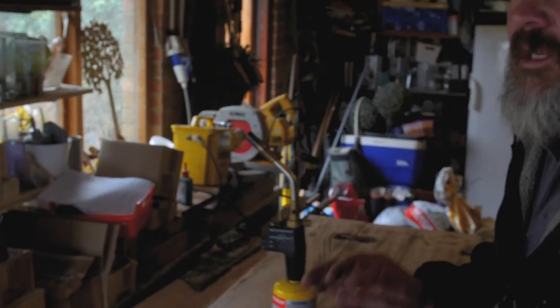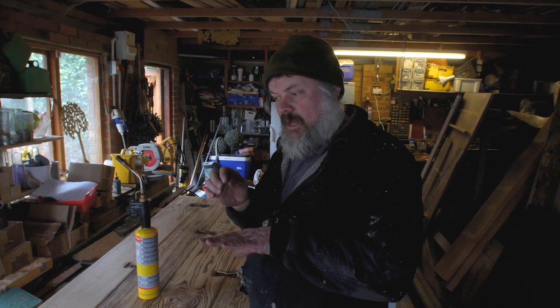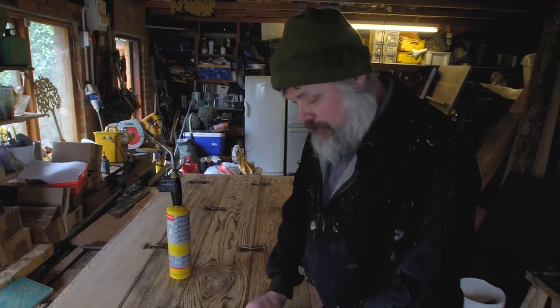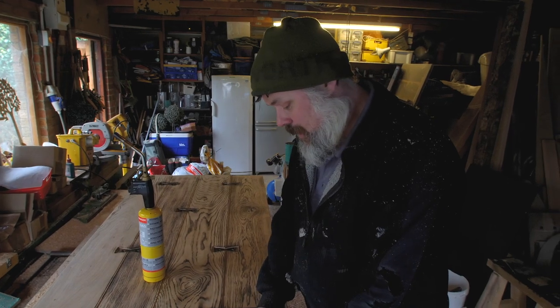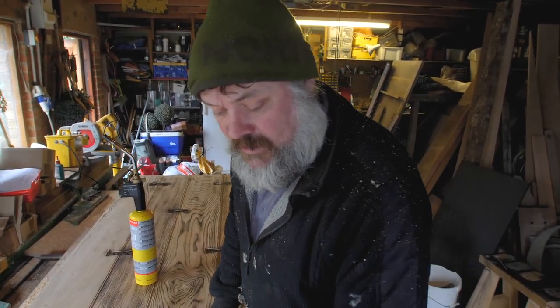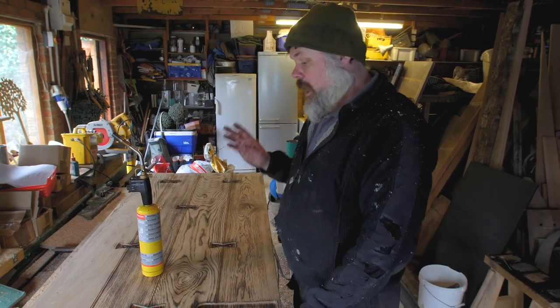We try to create, when we go a little bit heavy in these bits that we've let in, is steel and oak. When the two come together, if they sit together for any length of time, the steel kind of oxidizes and bleeds into the oak, so we're kind of trying to generate that look. I've done it before where we've riveted and we've made a template to create a long black streak above and below any iron fittings that we fitted, and it looks really good.